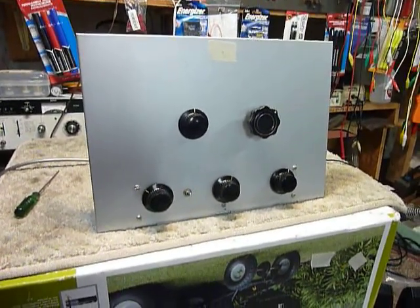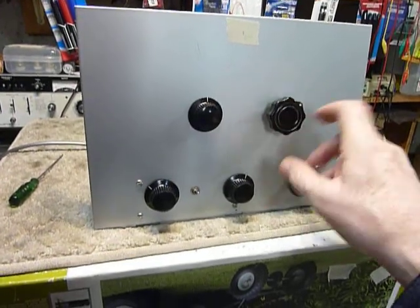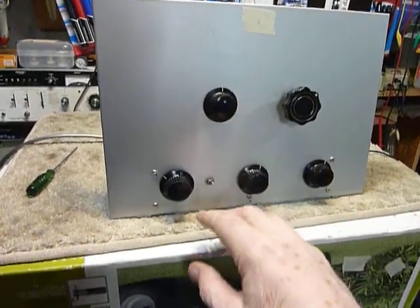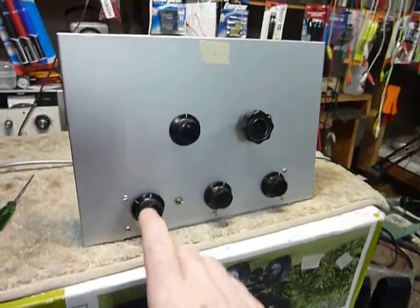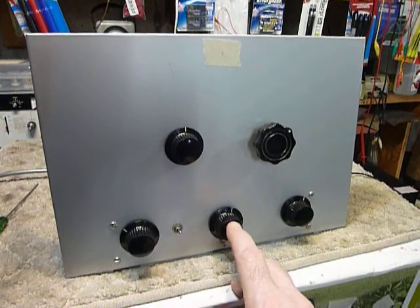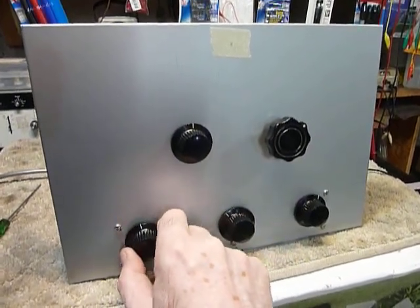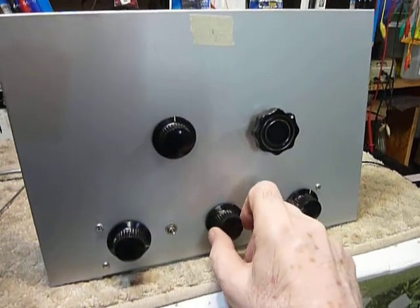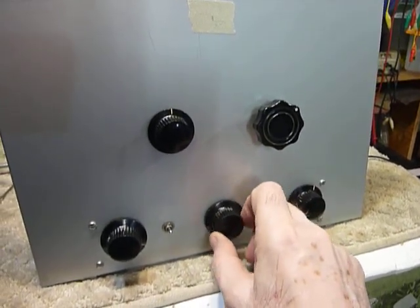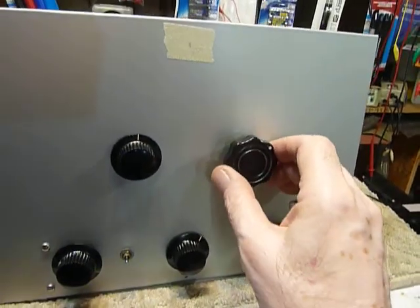It is a wonderful receiver. I just finished making the chassis today. I haven't got any labels on the front panel yet. I have a Filmore vernier dial — the little round ones with a reduction — coming for the main tuning and band spread tuning, and those are coming from eBay. This is the volume control, this is the regeneration. I didn't have a 100k ohm standard control but I did have a 10-turn pot. I got the thing running — you can see where the regeneration goes up too high with the 10-turn pot — and my golly, the stations are coming in. It's like a Superhet or something, really good.